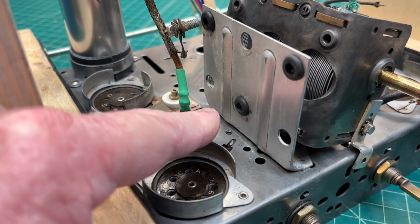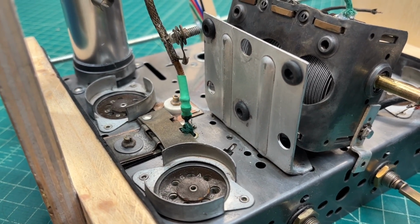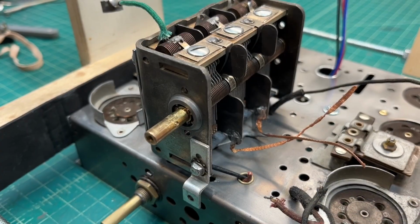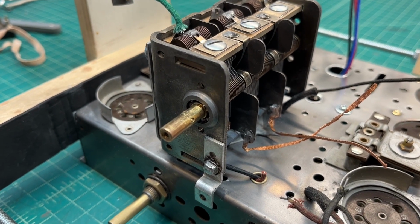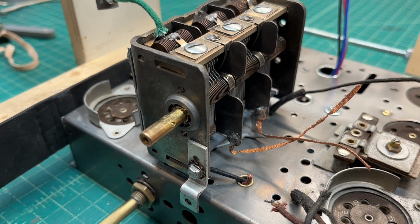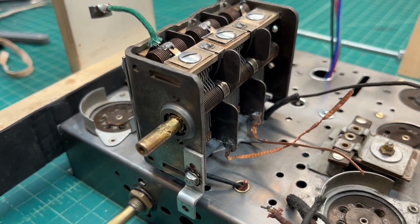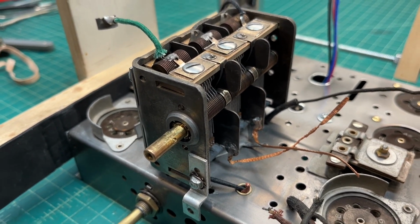As you guys can see, I've got the 3 new rubber grommets in place, and I'm going to go ahead and replace these old fasteners too. As you guys can see, I've got the tuning condenser remounted. Let me go ahead and get everything tied back into this circuit electrically. And then we can move on to the power transformer itself and get the E-caps connected as well.